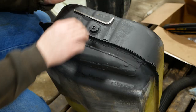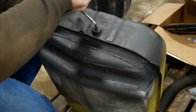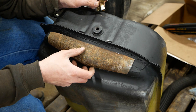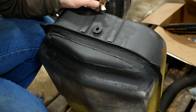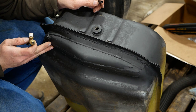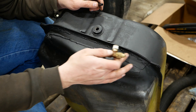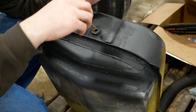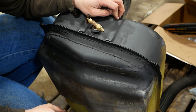Alright, the tank's done. That did not go well, let's put it that way. The big problem I ran into is that I didn't cut out a big enough opening - here it looks like solid metal but there's still significant amounts of rust. As soon as I started welding I just started blowing holes through that rust. What I ended up doing was putting a strip over top of the weld I'd already made, basically tripling the amount of welding I had to do. I was still blowing through and popping holes, ended up having to add all kinds of patches and it's a mess. But nobody's ever going to see it, and it's liquid tight, so I think it'll be just fine. I've definitely wasted - slash invested - way more time than I wanted to in fixing this tank.